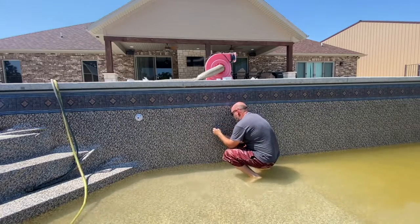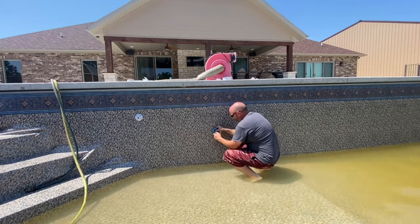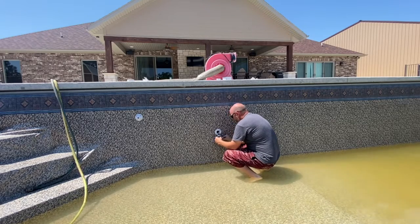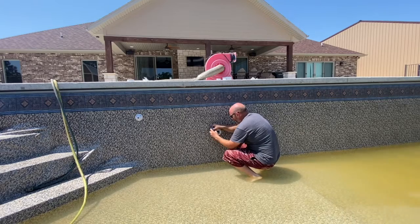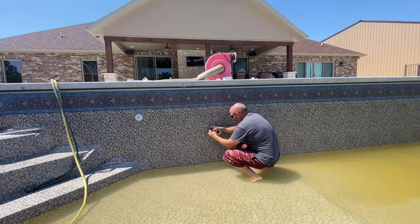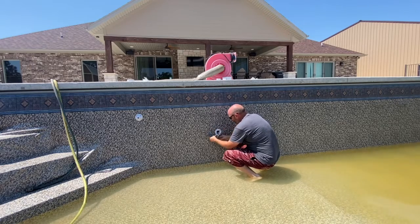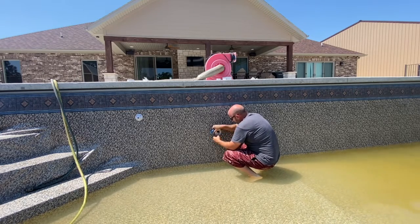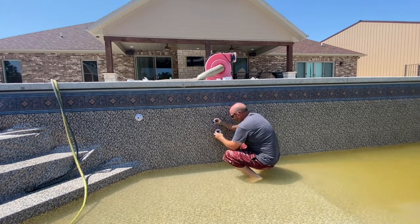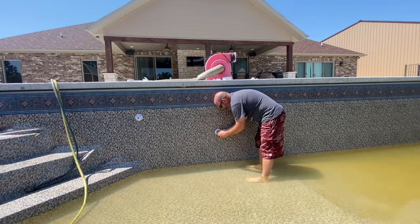Okay guys, so we're gonna really load it up with Teflon tape, because if we don't, like I said, that area where there's only 3 threads, I know why they did it. This little black flange here will bottom out, and that's basically all the room they have, but it sure would have been nice if they could have got one more thread, even if they had to make the thing a little higher profile outside of it, because it's kind of counterintuitive. You put so much Teflon tape that the threads start looking like pillows instead of nice sharp threads. But it's the only way to actually make this thing waterproof. Like I said, it shouldn't make anything leak unless your plumbing is all below grade. So I'm going to preload it with about 4 turns.